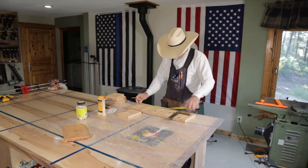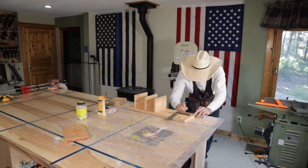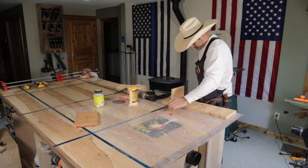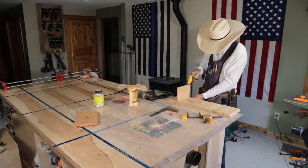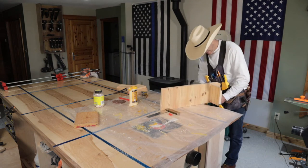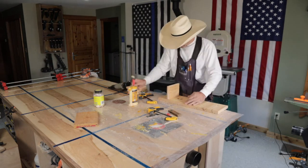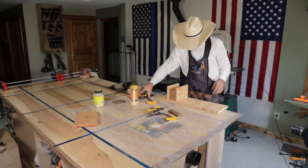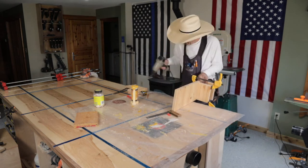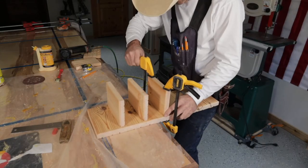The lamination came out really nice. I laid out the five shelves, started from the center and worked out both ways, grabbed a nail gun and started gluing them up. They were a little tricky to clamp — I had to clamp them at my marks and shoot from behind. Another option would have been to run dados to hold them better, but I just clamped and nailed them right where I wanted and it worked out pretty good.